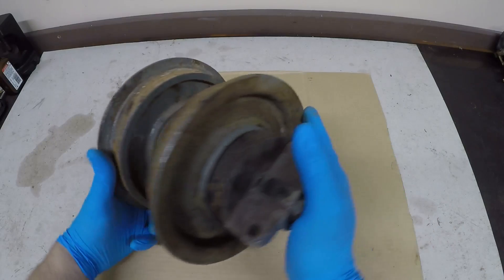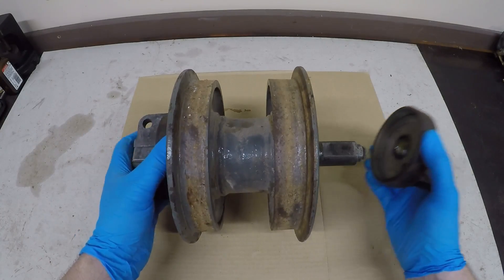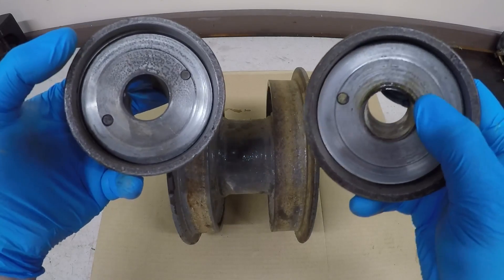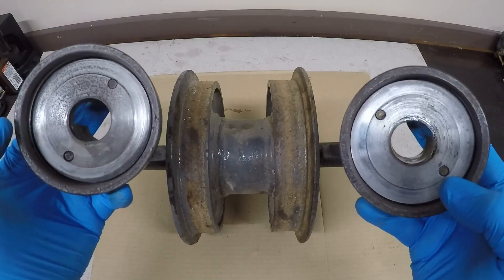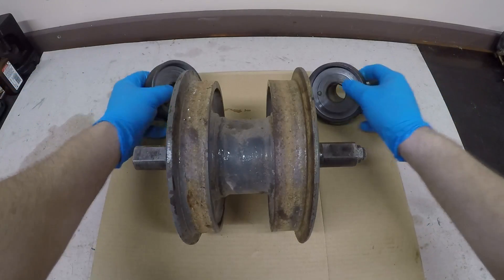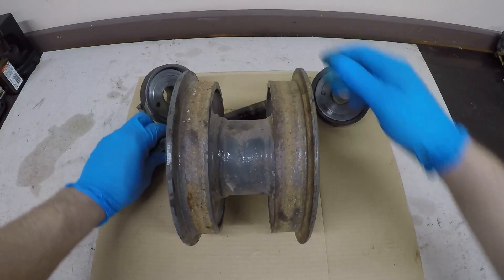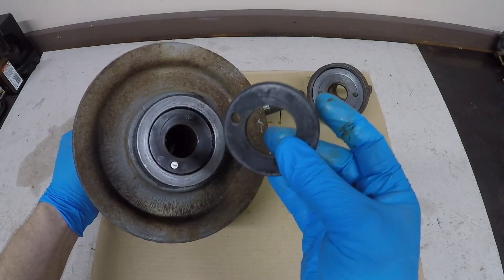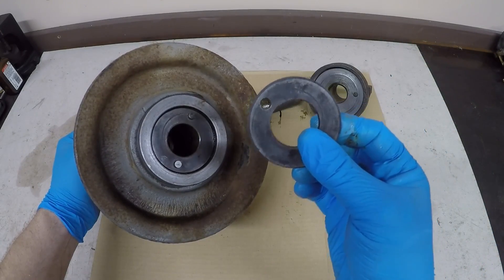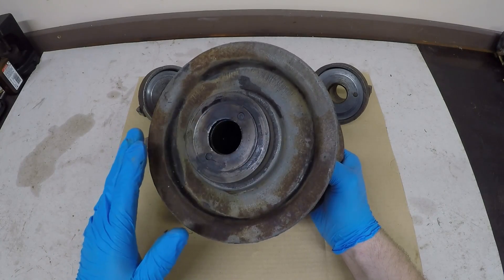Here in the shop I've got a Cat 10 roller on the bench. These things are really pretty basic — minimal design, very simple. To take one apart, the bearing caps come off each end; each cap has a large thrust washer on the back side located by two little dowel pins. Usually these are really greasy when you take them off. The roller caps come off each end and you can slide the roller shaft out. Then you have smaller thrust washers on your bearing bushings, held in place by two little dowels.